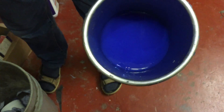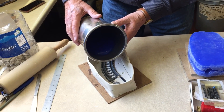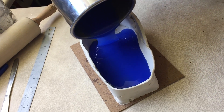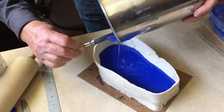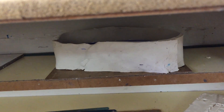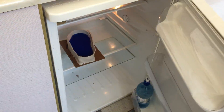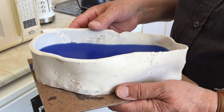All the bubbles will begin to explode, getting rid of the air in the mould. Now the rubber is perfectly smooth. You can begin to pour into the prepared area — pour it nice and gently from one end to the next. What you want to do is avoid trapping air inside the mould, as air bubbles will contaminate the final casting. Put it into a fridge for a few hours, then you can take it out and get on to the next stage.